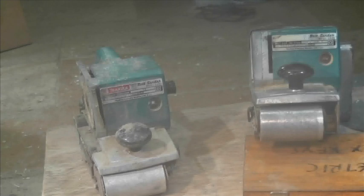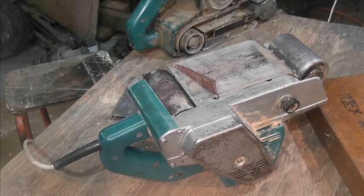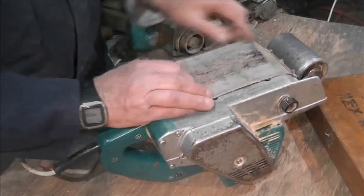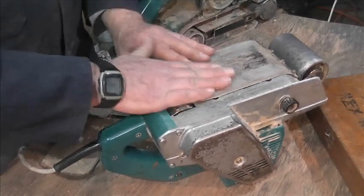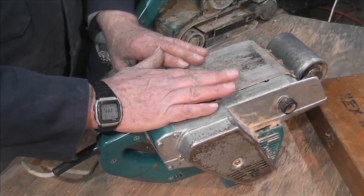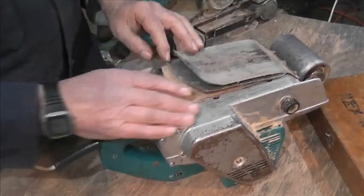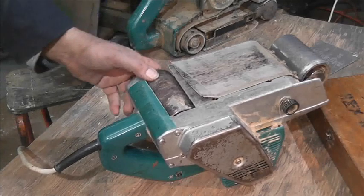So we've got some spares. First thing — there's normally a pad here, held on with four screws. Once the pad has worn out, it used to have some sort of mica finish, something that looked a bit like cork but really thin. You just use a couple of old sander belts instead — that works really well and saves you loads of cash.